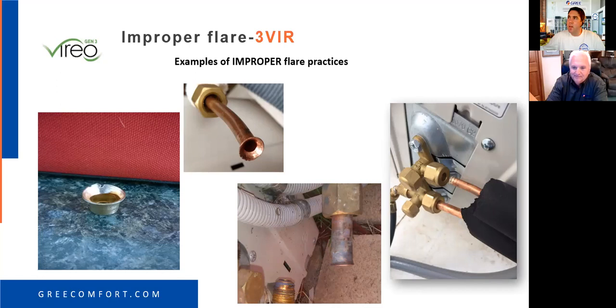Oh, most certainly. Just a little bit of refrigerant oil on the threads and use your torque wrench, and you're good to go. As you can see here, this is what I did on the 1/4 inch lines, the very first one that I installed. Every time I went to try and tighten it, it broke the flare because I was using an adjustable wrench and way too much torque.